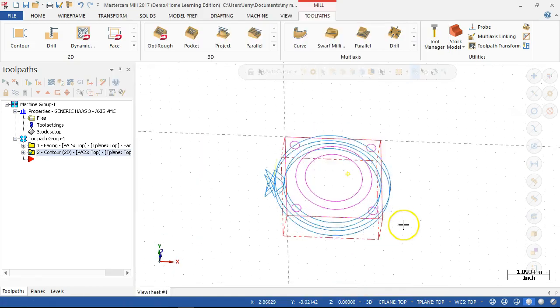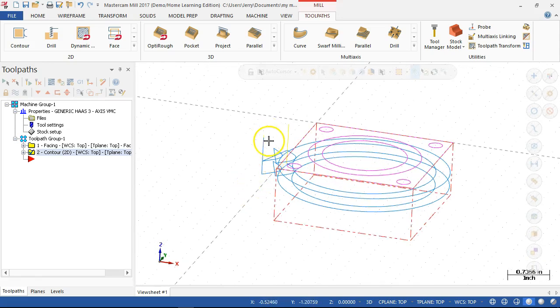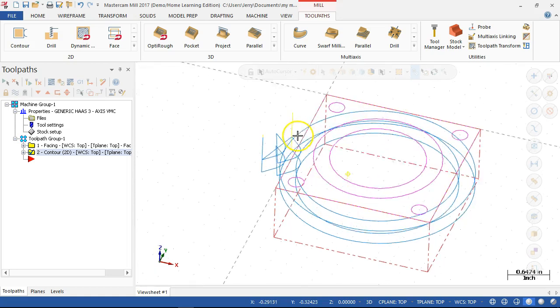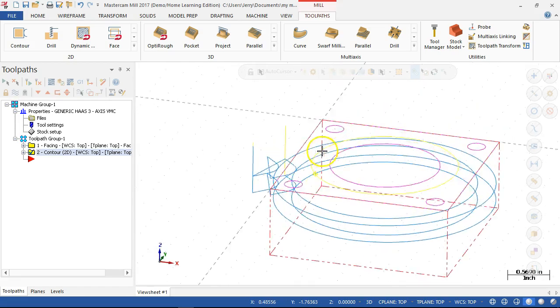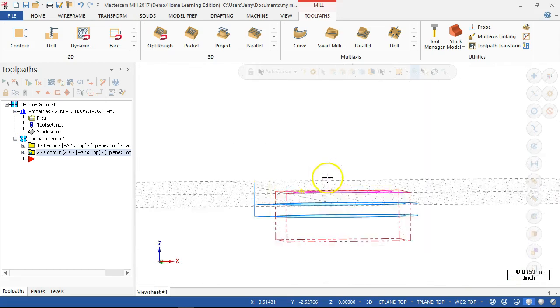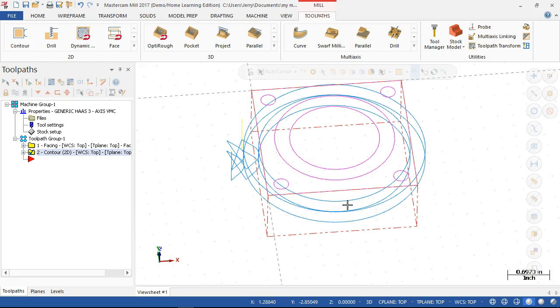Accept. All right. So the rapid, or the feed in out here, makes the pass around, feeds to the next level, tool stays down. Feeds out, goes to the next lower level, feeds around, and then the rapid is out. So I may only be saving a little bit, not rapiding, jumping over to the next level, but it is going to be enough, basically not wasted moves.